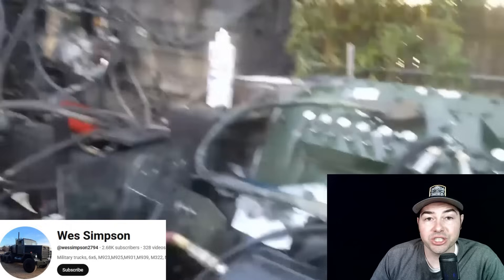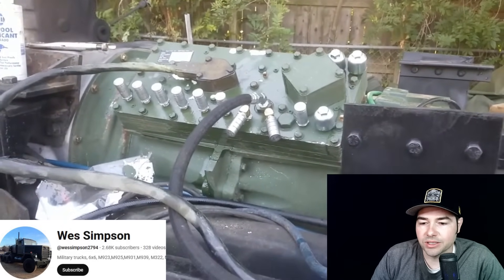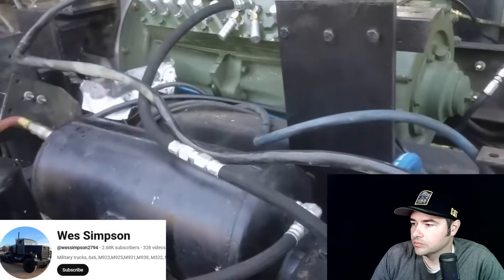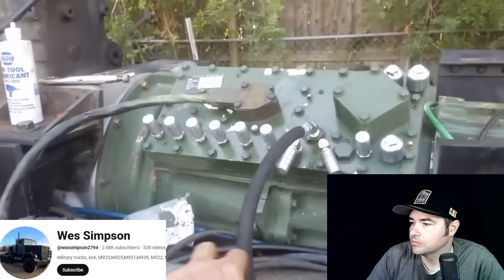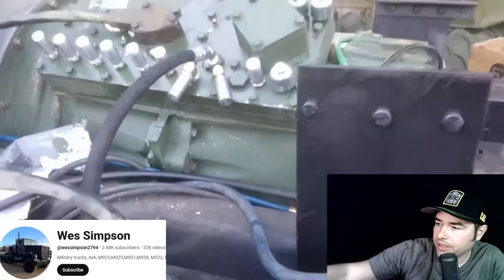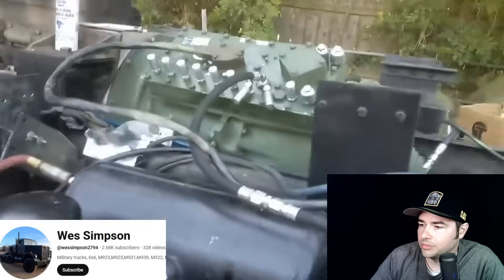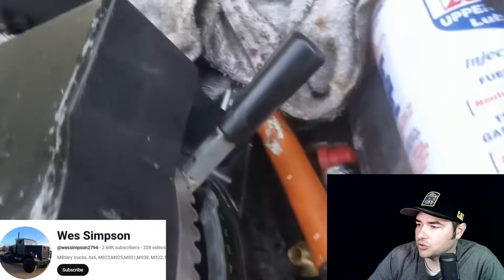Here's a video of them actually shifting through the servos, showing the transmission itself in a military vehicle. Right now they're just doing testing, making sure the valve body is operating properly. You can see the umbilical cord line — it's got a few air leaks on it. There's an air-in port and then that three-bolt pattern is where the umbilical cord runs, connecting it to the shifter. There's no clutch pedal or brackets — just air in and then the controller shifter.